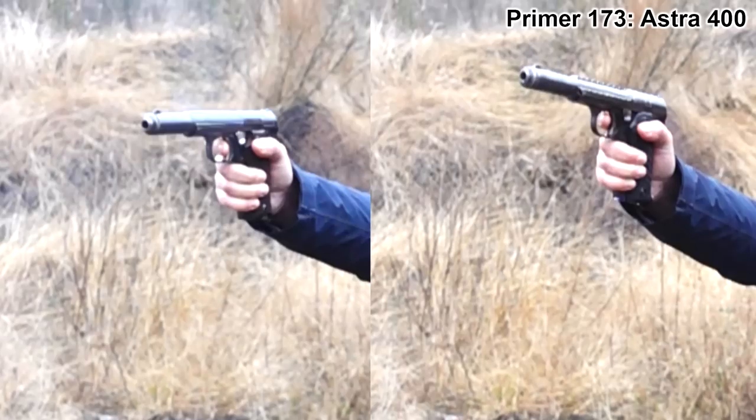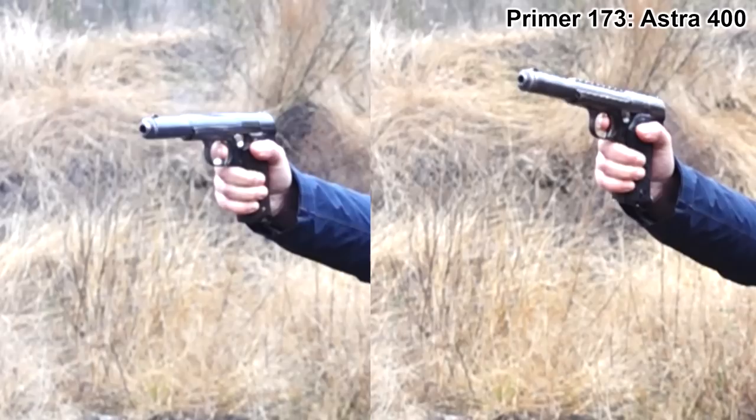We'll have to do a side-by-side, but... Yeah, because I think we kept the camera pretty close to each other, so we might be able to see a very comparable side-by-side in the high speed for that. They are definitely very close from initial observations. Yep. Which is fair, because it's the same recoil spring, it's about the same mass. Uh-huh. I know when we're handling it, and we're moving at such slow speeds, we're getting a little bit of drag from this fitment. Yep. But I don't think that tight fit's really doing much for us when an actual case is coming flying back, right?